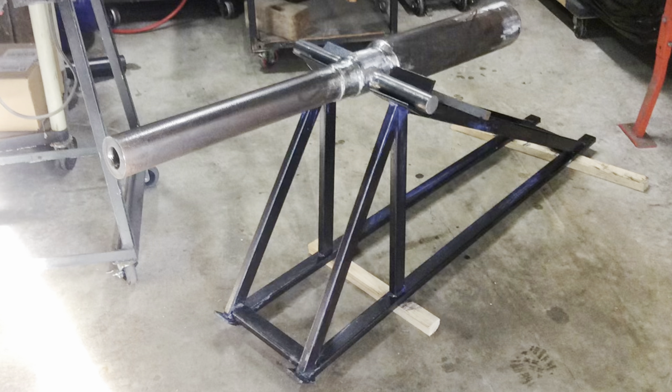On to our photo section. You can see our barrel here is on our stand — we didn't have our carriage built yet, this is just how we manipulated it around in the shop. You can see our barrel here: the initial barrel, the original drilling stem pipe, the second reinforcement, and the third reinforcement outer pipes, and how they're slid into one another. We've got our trunnions welded on — they're way longer than they need to be at this point, haven't been cut yet. Everything is filled with lead at this point. We don't have the reinforcing bands on or anything. This is the cannon just in its raw barrel form.